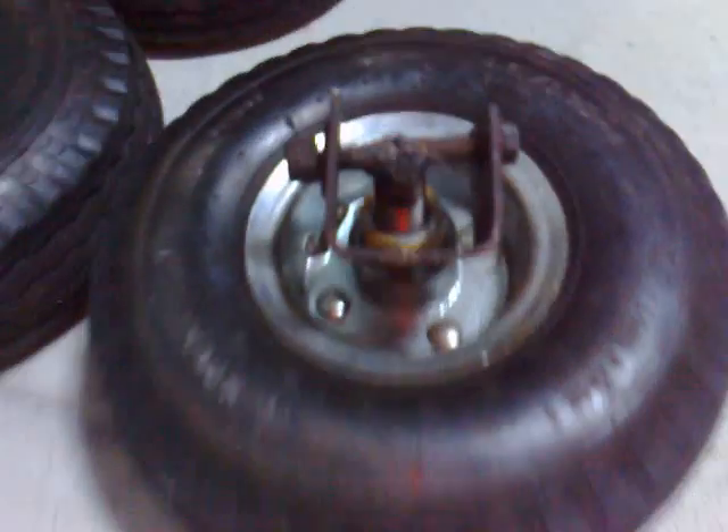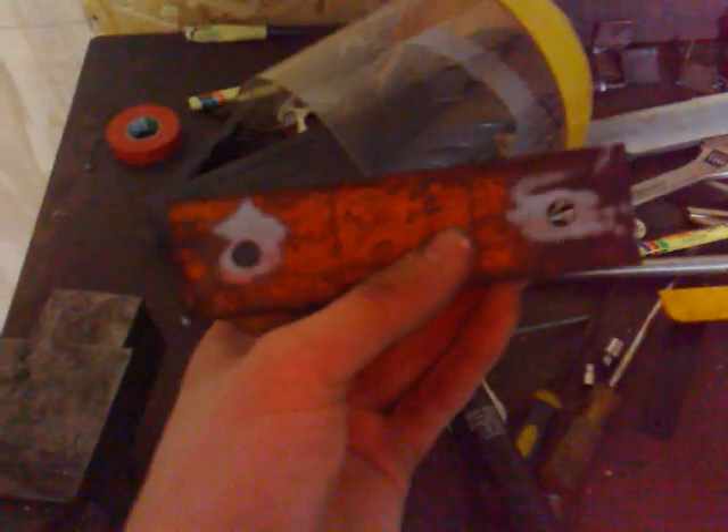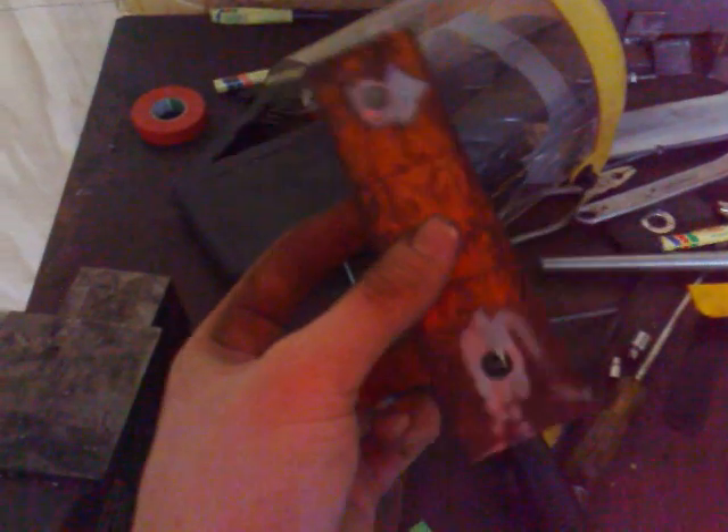What I'm going to do is put them in the vice at the five-mil mark and bash it with a hammer, then put the other side in the vice and bash it again, and it'll come out like those ones. With those earlier ones I drilled the holes after bending, but on these I pre-drilled the holes beforehand so when I bend them they're all lined up and nice.